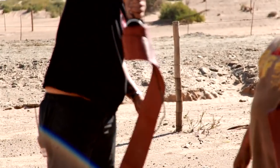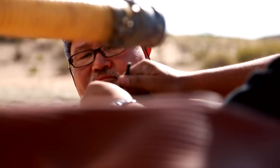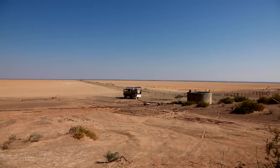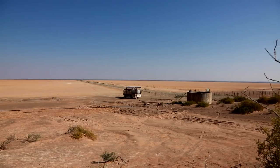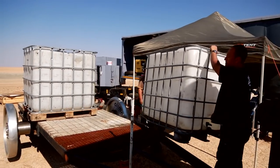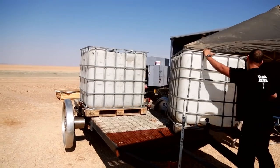The main objective is we're trying two new wheel profile shapes on the pan here. We came out in November last year to do our first testing and it became very clear that the wheels we were using were cutting through the thin mud layer on top of the surface and running on the hard bedrock below. We were seeing quite a lot of damage to the wheel as it was running on the surface. So we've got two new wheel profiles here today.